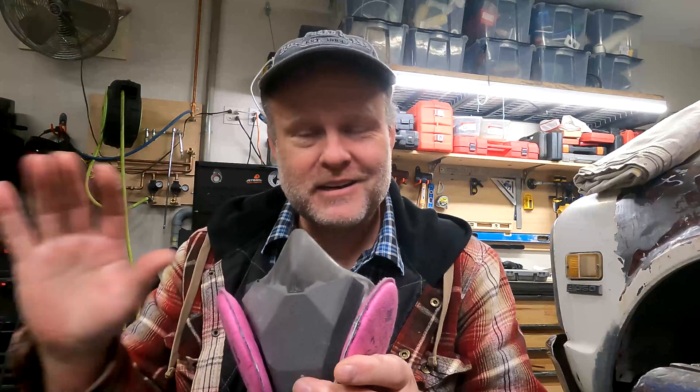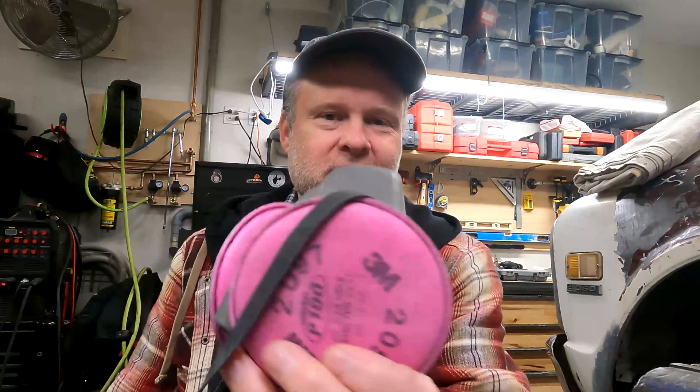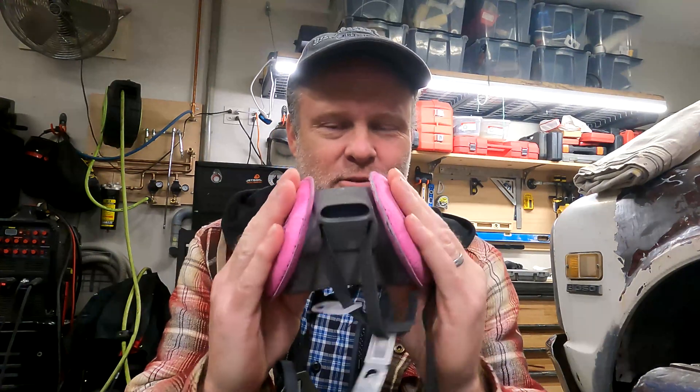Wait — I totally forgot one important thing about safety. Welding stainless steel is a little dangerous in that it gives off a poisonous gas called hexavalent chromium, so you really do need to wear respiratory protection. Get a fan, evacuate the air as best you can. I'll link to a guy I follow for welding tips who has a more detailed video on the dangers. I got a 3M 2097 respirator — it's good, it's not hot, and it actually fits underneath my welding helmet. So go do that. Have fun. We'll see you in the next one. Bye.